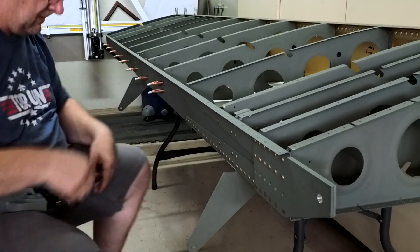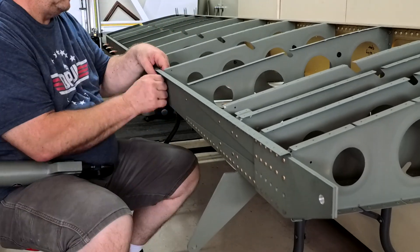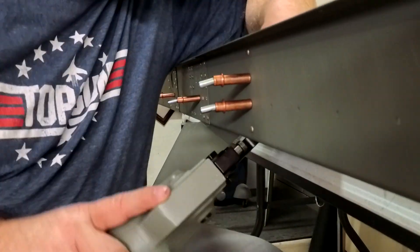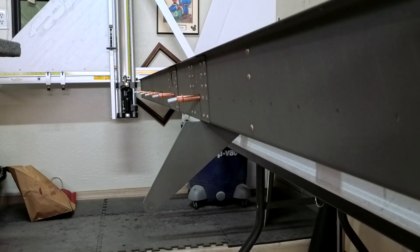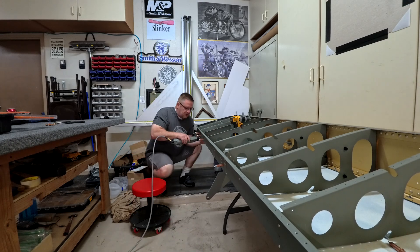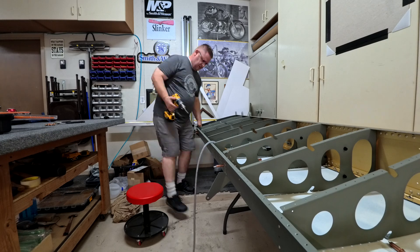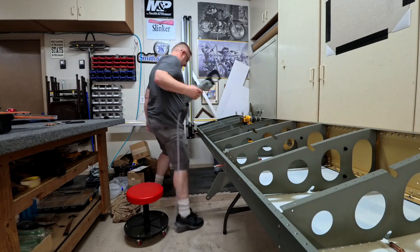You'll notice I'm not riveting all of them — there are two at the top and two at the bottom. I rivet the two at the top and only one at the bottom. That's because there's a piece of aluminum that attaches to the rear spar and to the skin itself — it's where the flap and aileron fit up into the wing. Those holes will eventually get rivets, but not yet. Then I just work my way down getting all the ribs attached to the rear spar.